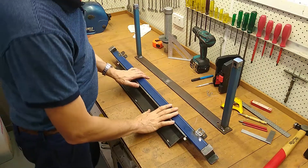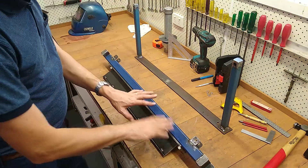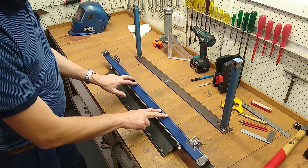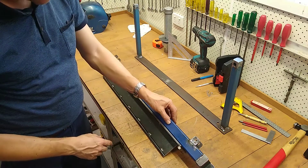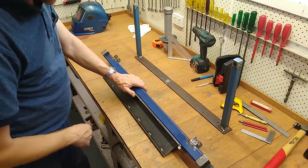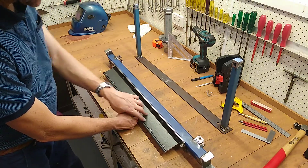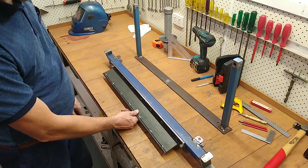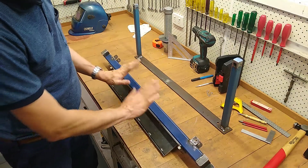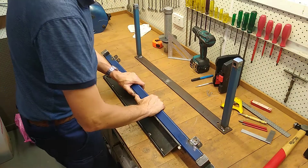I haven't painted this yet because I just want to test it out first, just in case there's a little bit too much deflection. This is 40 by 40 by 3mm — with it being 3mm thick, it is quite sturdy and quite strong. The punch is 65 by 6 and I don't think we're going to get any deflection out of this. But you never know, so I thought before I paint it I should probably just take it for a test run. Let's see how it works out.